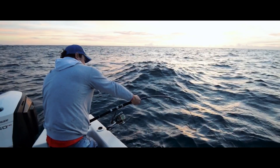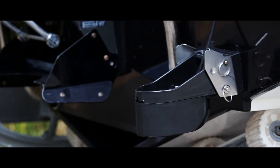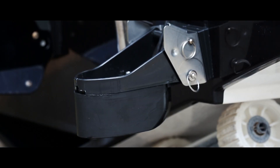I originally started with a wet box just to try and keep everything off the transom, because these boats have a flooding keel which makes it hard for through-holes. It was a good transducer but I didn't like how it picked up at speed — one of the chines was running over the face of it — so I went to the transom-mount TM275 high-low-wide.